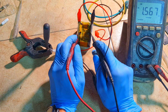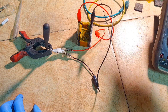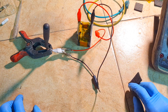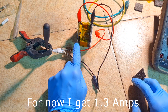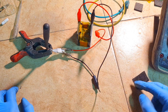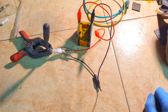This cell is for demonstrating purposes. I think it can be improved by adding more carbon fiber to increase the surface area, which also increases the power output. Also, the positive and negative electrodes work better when they are close together, because a greater distance between them requires more charging voltage and reduces power output. Guys, that's it for now — see you in the next video, bye.